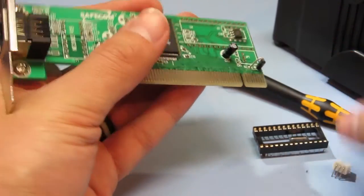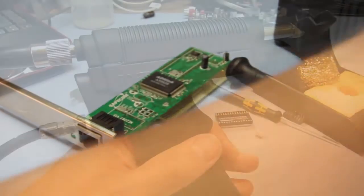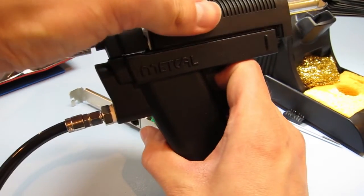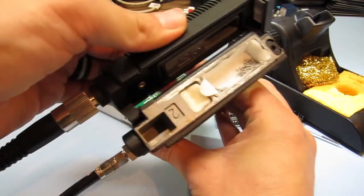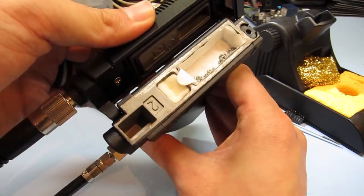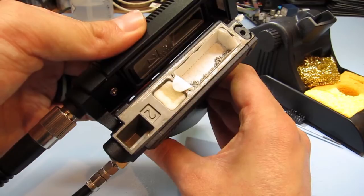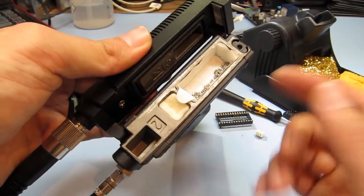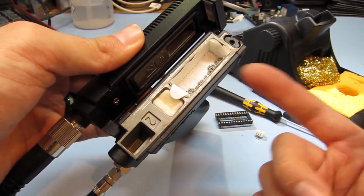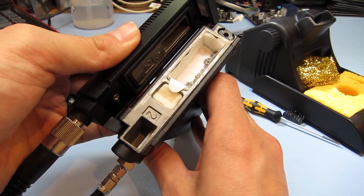That's the connector out. Overall, not too bad. Inside the iron, if we remove the top of the chamber we should be able to see that's where all the solder collects. There's a fair amount in there but you could desolder quite a lot of parts and a few boards before you have to empty this. You don't have to change the filter every time — you can just empty out the parts and when the efficiency starts to drop then you replace the filter.